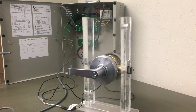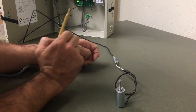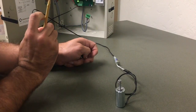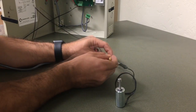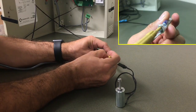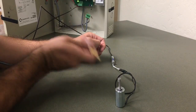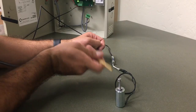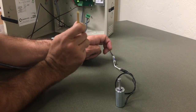Here we're going to start off by showing you the most efficient adjustment for a 24 volt solenoid with a 24 volt power supply. I'll start off by dialing the potentiometer counterclockwise until it stops — that's at the lowest point. I can see here that the solenoid is bouncing; it doesn't have enough energy to hold in the plunger.